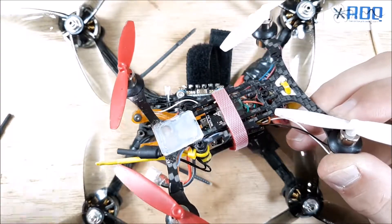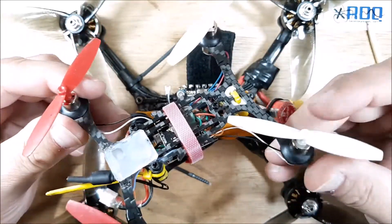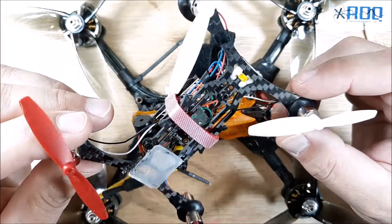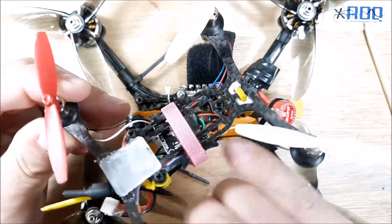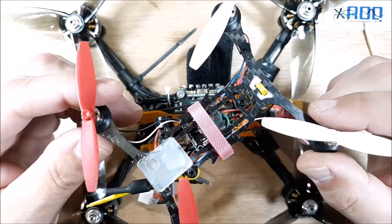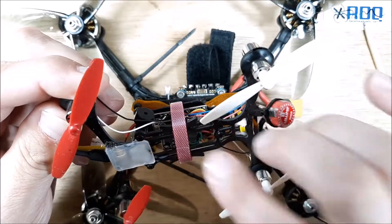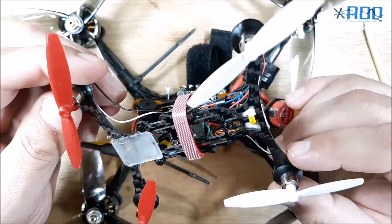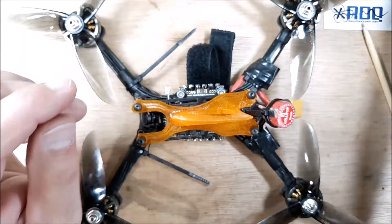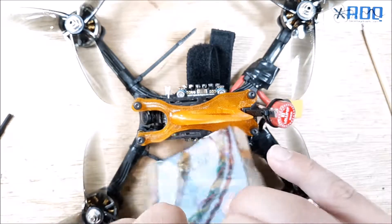I built this one — I called it a feather trainer because it's super light and it's throwing 66 millimeter props. This thing moves pretty fast for a brushed quad. It has a VTX in it — just a tiny little VTX, I think this came out about three and a half to four years ago. Again, you just have the power in — in this case five volts — your ground, and smart audio, which I don't actually have on this one. But just a general lowdown: every VTX you find is going to have pretty much the same features.